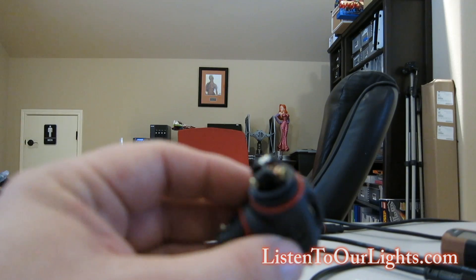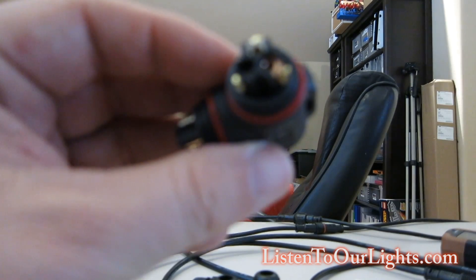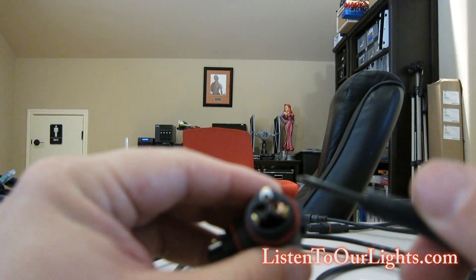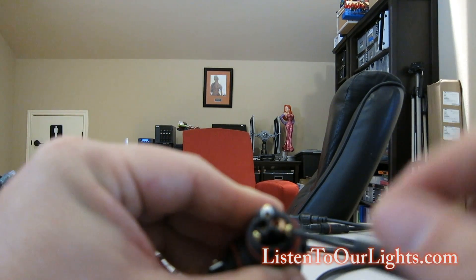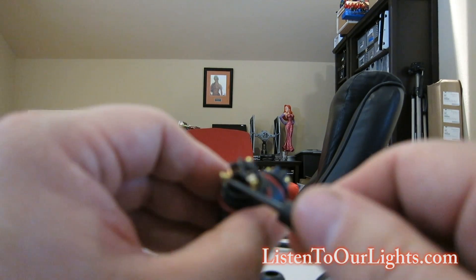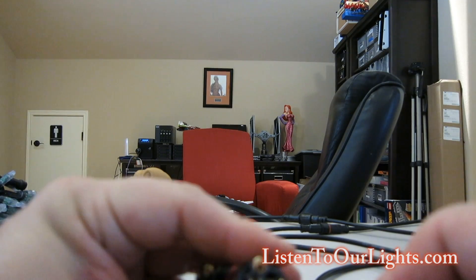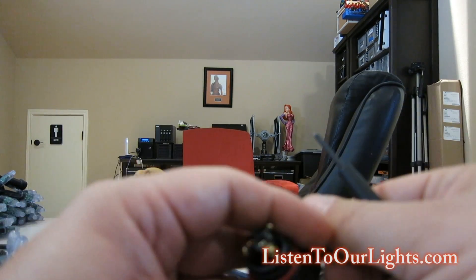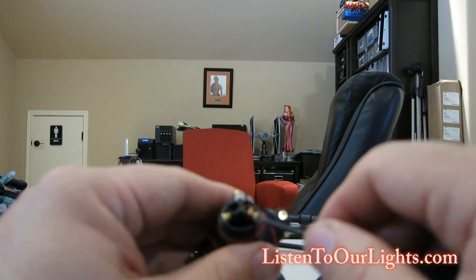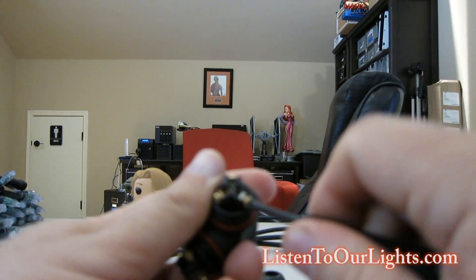Let me explain what you're seeing here. When I pull off these tops there are three holes, and each hole has a screw. Each one has a little screw — this one is a copper color, we'll call that one red. This one is in a black housing, we'll call that one black. And this one is silver, and we'll use that one for data. Each side has these little screw-down connectors — you stick the wire in the hole, tighten up the screw, and it holds it in place. No solder. And it has this nice beefy wall so that you're not unintentionally touching each other.